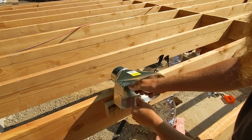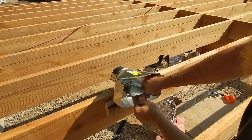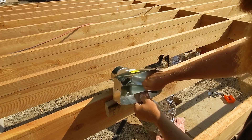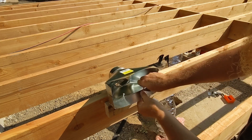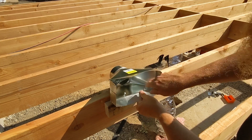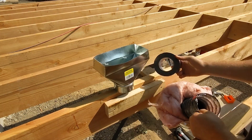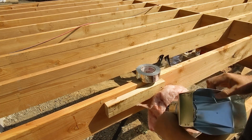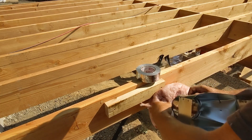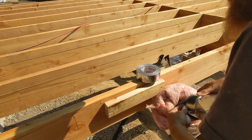Our crawl space up until about here is head height, and that's two thirds of the building. Then there is one small section that is a two-foot space. So we talked to the county about being able to wait on putting in the main trunk and just running the flex duct so they could see where everything was going. The main trunk is going to be in an area with seven and a half feet of head height, so they were fine with that.